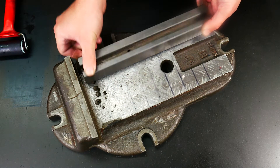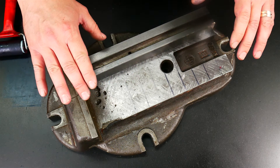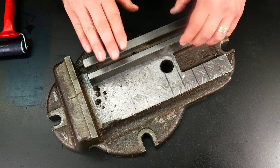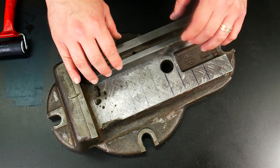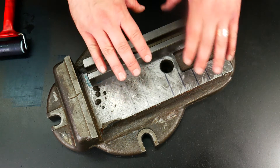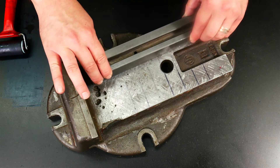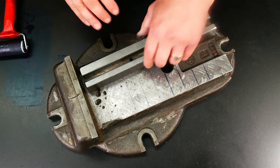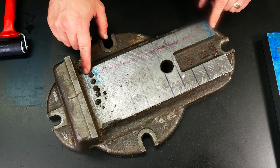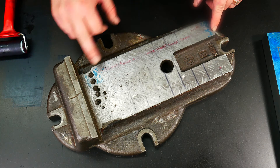We've got a two thousandths difference. This is a zero here as well, so between here and here is about one and a half thousandths, and of course we've got a dip here. So what we're expecting to see is some blue here and some blue here, and not really much in the middle. We flip our straight edge over — there's a little rock there, but that's not the straight edge because that's been scraped flat to this surface plate. We run it backwards and forwards, and there we go: you can see there's very little blue here, a little bit of blue here, and nothing at all here — which is exactly what you'd expect if this area is high, this is sort of in the middle, and all of this is low.